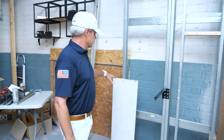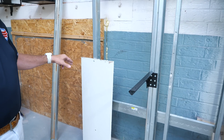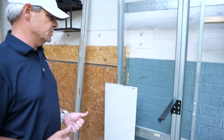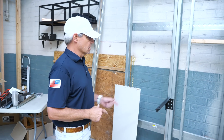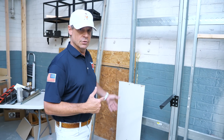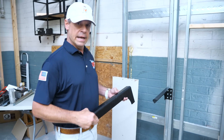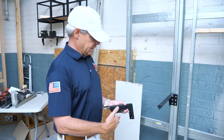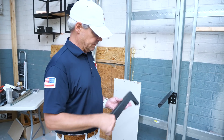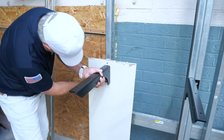Now we're going to move over to the single stud front flange metal bracket through sheetrock. This is a key advantage where you don't have to cut sheetrock — you can go straight through the sheetrock to the front flange of the metal stud. This is the right-hand version with the downward flange on the outside top flange, holes on both for attachment, ease of attachment. We're going to mark our holes.